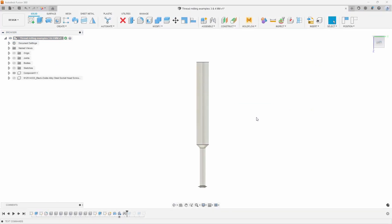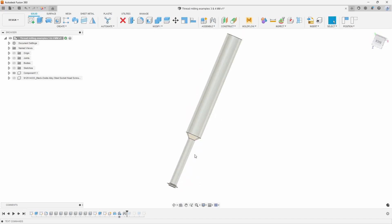By quickly downloading that tool model to Fusion 360 we can take a look at what that tool actually looks like. There are a couple ways to do this — you don't actually need to download the tool; you can simply create the tool in Fusion 360 as a tool library. But if you wanted to create the form tool to get a more accurate depiction of the tool you could also do it that way. For today I think it'd be fun to show you how I would use this if I wanted to bring it in as a form tool instead of using Fusion 360's regular tool library to create a thread mill. Let's actually use the form mill option to bring in the most accurate model of that particular cutter.